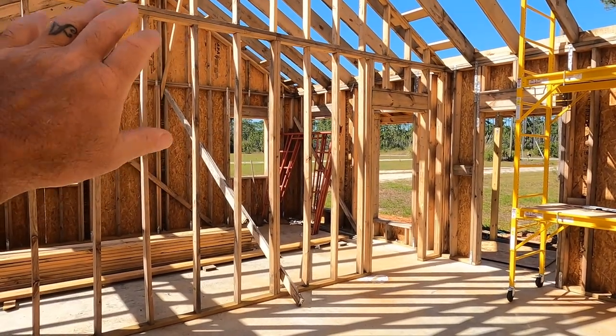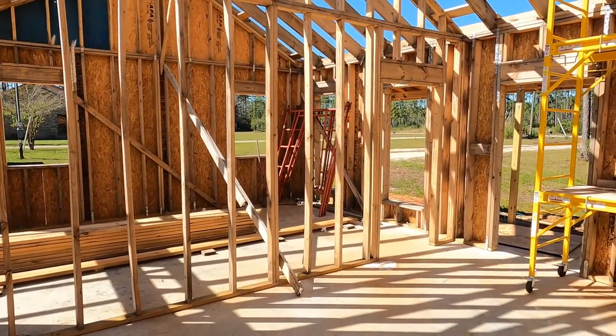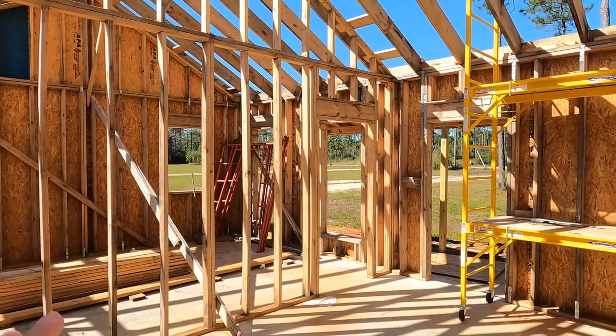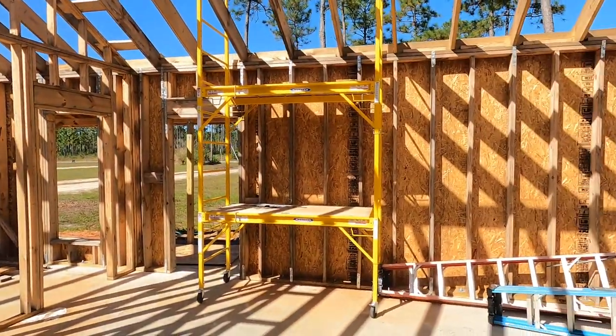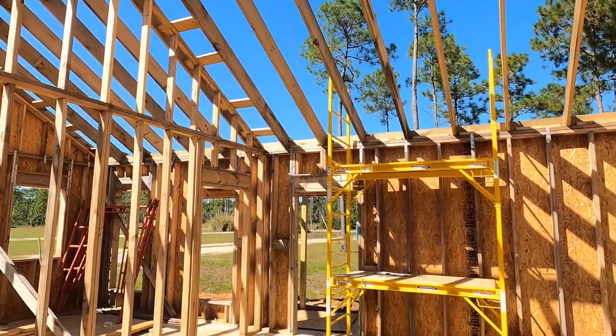There's probably going to be a TV on this wall here, a little wood burning stove, but regardless I can use a pretty good product in there to deaden the sound. Two by six framing on 16 inch center, cathedral ceiling in here again.